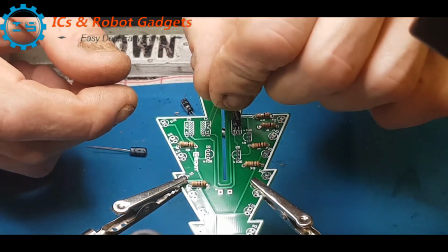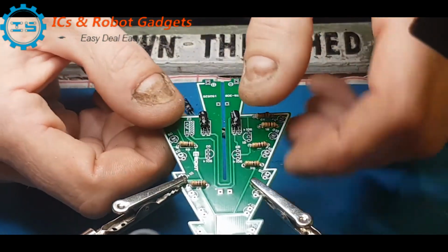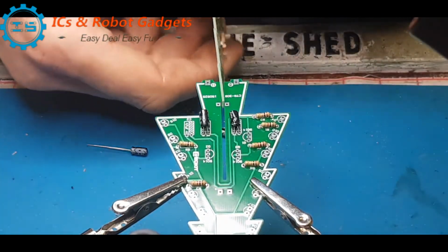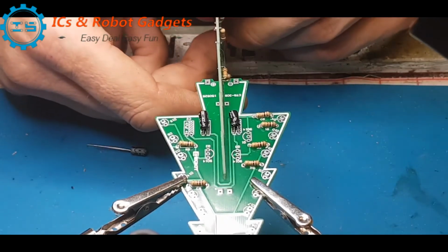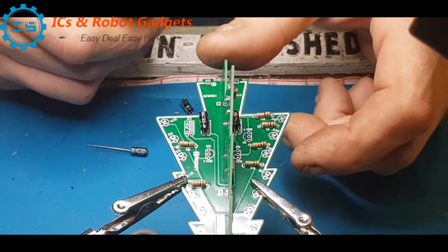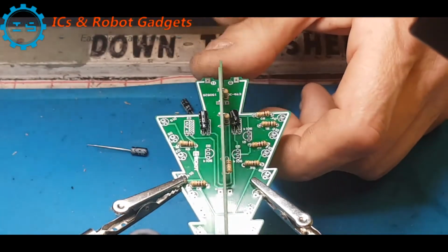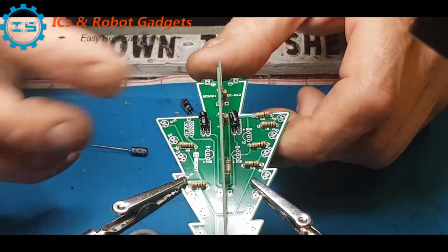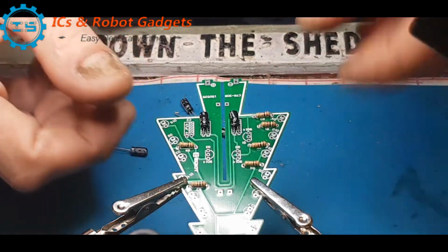constructing, and you could end up with not enough room when the board, you see the slot, these actually go together like this, and then you solder, you can see the arrow in that pad there, and then you solder the pads together. So eventually these will go like this. So as you can see in the picture now already, they wouldn't actually get in the way much there, but it does save the room and it looks better on the PCB.